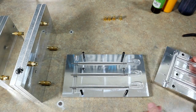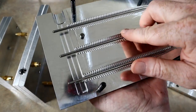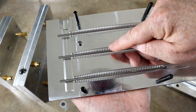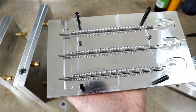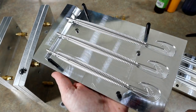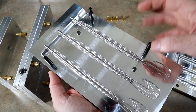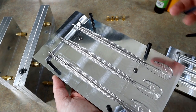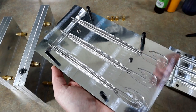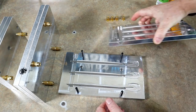And of course, this is a core shot mold. So here we can see the core rods looking good, looking fresh, and it's a really wide cavity bait. So your shells are gonna be thicker, right? Whenever you're doing your shell color, you just have to keep in mind that for transparency's sake, so that you can see the core effect, you don't want to put too much pigment in your shell color, because the thicker the shell, the more difficult it can be to see through the shell to get that core effect.